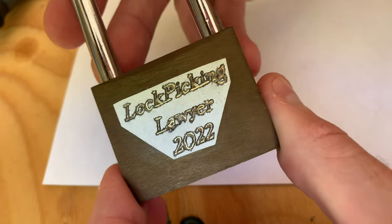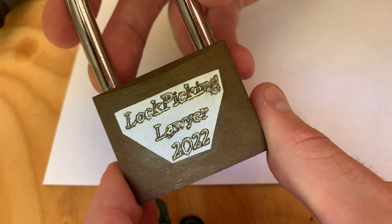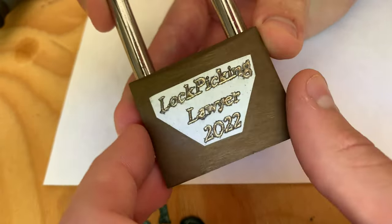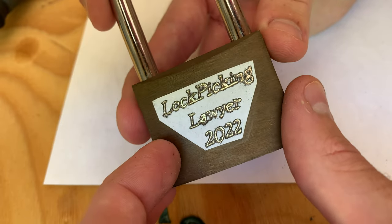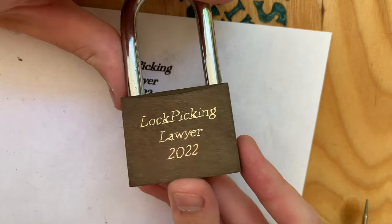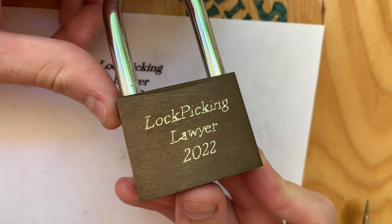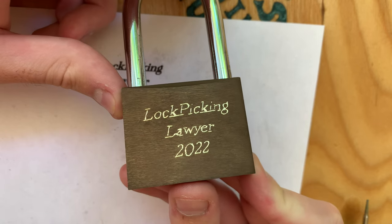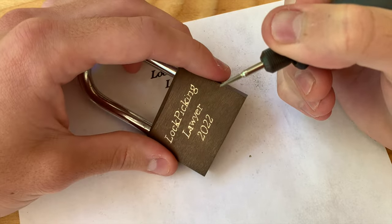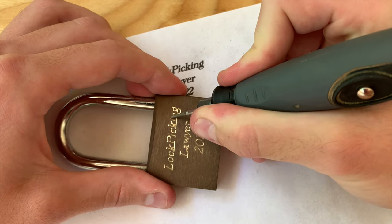Alright, we've engraved through the paper. We can clearly see we've gone through the patina of the brass, so we know we'll be able to see the design once the paper is removed. I use school glue since it's not waterproof, so a quick rinse under the tap will take this off. Here we are with the glue all cleaned off. We have a rough outline, but as you can see there's some flaws, some missing spots, and overall it's not very thick. So we can touch it up with the 7134 as we eyeball it and compare it to the original font. I print two just so I have a reference if I need it.